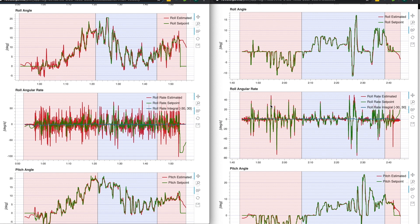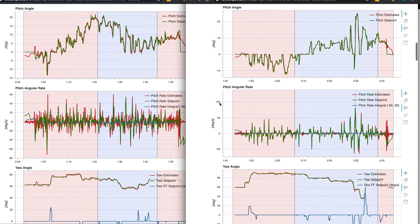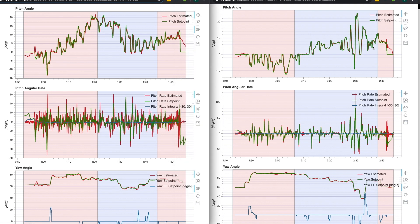On the left is the problem scenario with the white sticky foam, and on the right is with the 3M foam. The flight review documentation recommends looking at your roll, pitch, and yaw angles and rates. What we want to see is that the red and green lines are tracking together fairly well. On the left it doesn't look too bad, but on the right we definitely have a lot cleaner tracking. When we get down to the angular rate, you can see there's a lot more noise in the problem scenario. The pitch angle tracking is actually pretty good in the problem scenario, but on the right it's much cleaner, and the angular rate definitely has a lot more noise on the left.